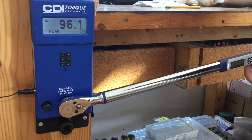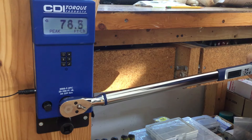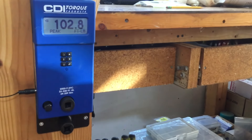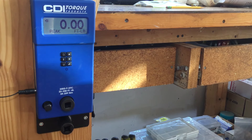96.1 — 102.8. It took a lot of practice messing around with this thing, but just going by the green lights and stopping before the final 10%, at 150 pounds I averaged 0.73% under; at 100 pounds minus 0.1%; and at 50 pounds plus 3.05%.